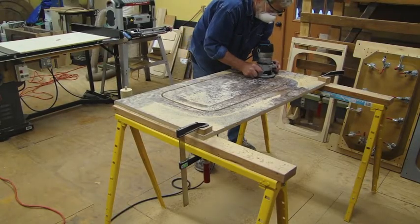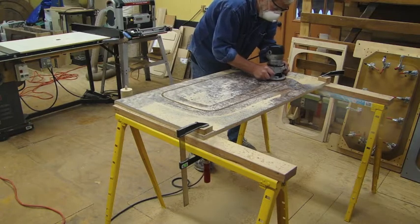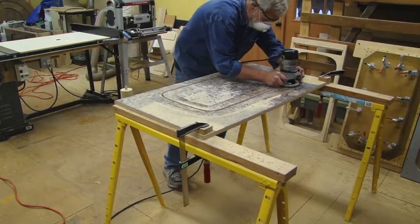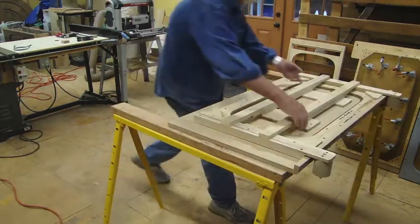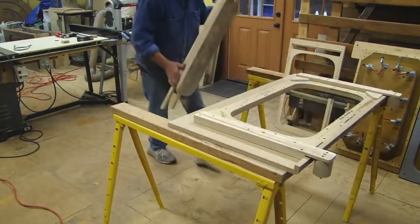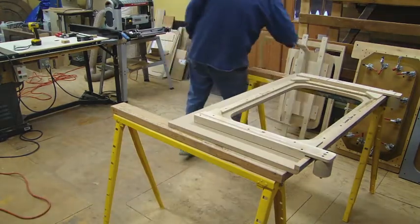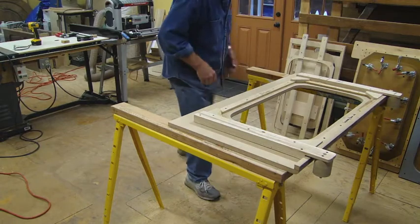The center support jig keeps the center slug from ruining any of the other parts of the system. With the same setup, we're making two passes with the router — one to make the finished hole for the sink and one to perfect the edge of the laminate for encapsulation. These simple and precise fixtures ensure that we'll get a good part every time.